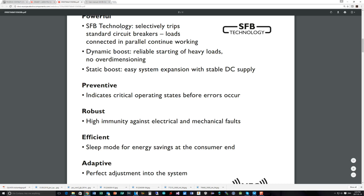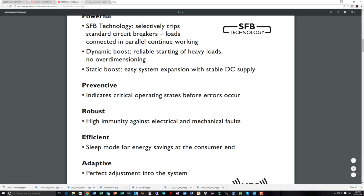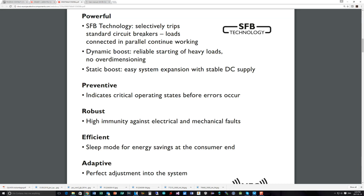Through the configuration, you can selectively trip the output of the power supply, simulating different kinds of circuit breakers, either by hitting immediately the load that you've specified or allowing, say, a 20% overload or even more. We'll look at the configuration as we come to it.